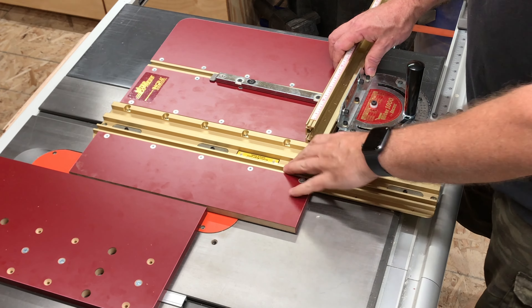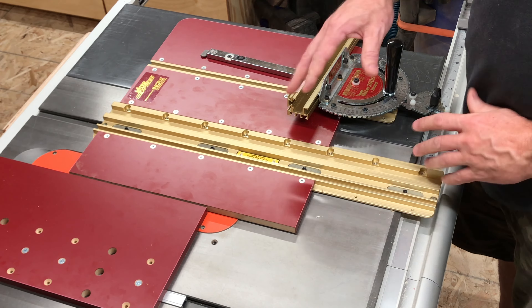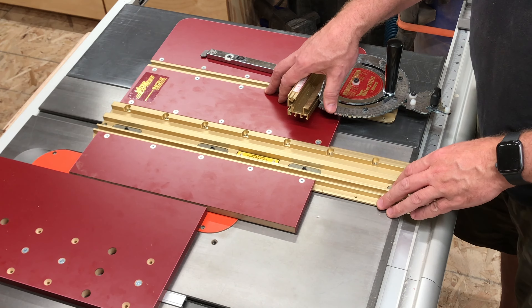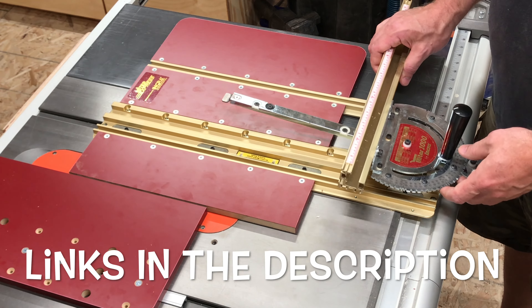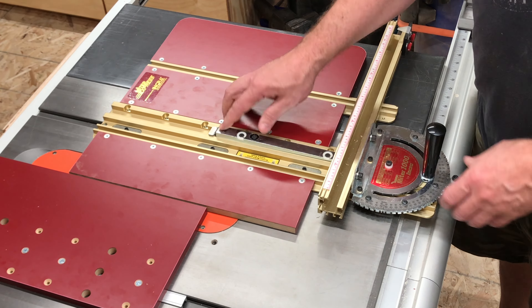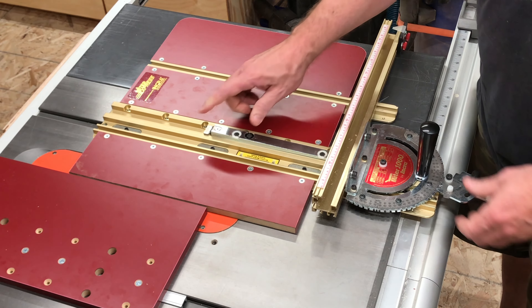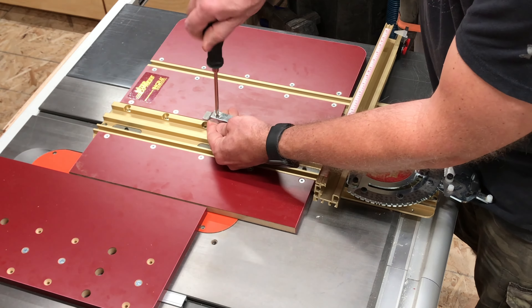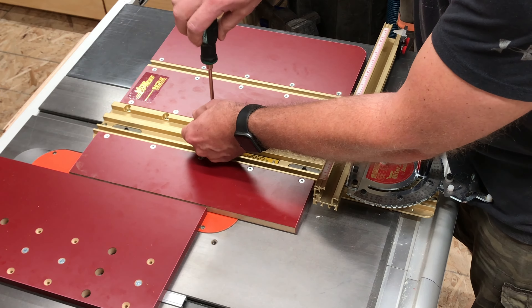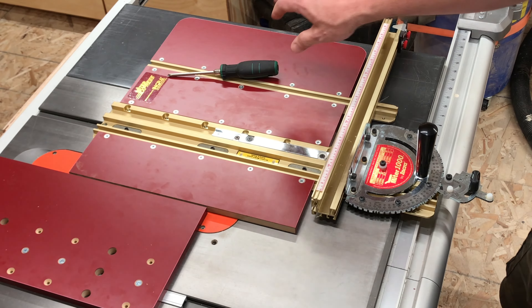Now it's time to drop the miter gauge into the saw slot. The miter gauge pad is designed to work with any miter gauge, so it'll work with the miter gauge that came with your table saw — I just happened to buy these two together at Rockler, link in the description. This slot where the miter bar goes does not have a T-slot, so if your miter bar has a T-slot retaining clip, you won't need that — go ahead and remove it. My job site saw did have a T-slot, so make sure to keep track of that and don't lose that little screw.